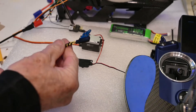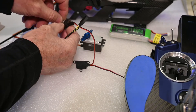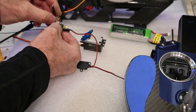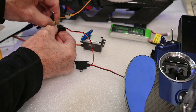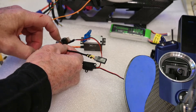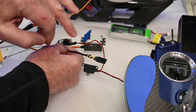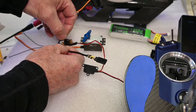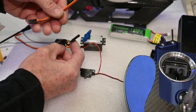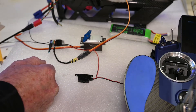The cable I made up is connected to the R6. I will disconnect the Brain 2 and connect my cable to the receiver. It's quite easy to identify the proper wires coming from the Archer — all the Archers I have hook up to the S-port using the black, red, and yellow wires. This connector will be hooked up to the servo to be flashed, and I am ready to flash the tail servo.